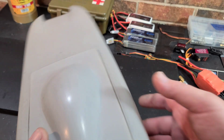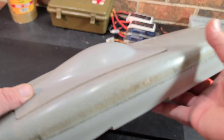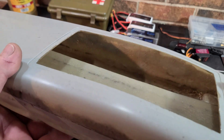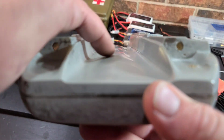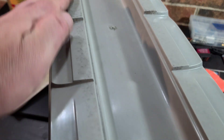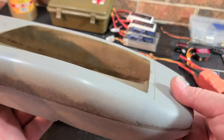I think the boat's got a lot of potential. Whoever designed this boat made it thick — it's got a nice thick layup. It's heavy in the bow, which is kind of what we want for a catamaran. The bottom was well thought out — the tunnels have a little air dam diffuser, and the strakes were thought out. It's got this overhang in the back which brings its own little problems we need to overcome.